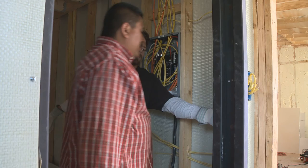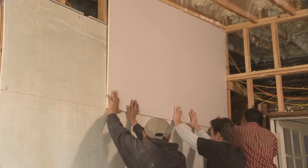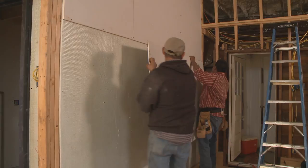Once Armor Core is in place, the drywall can be hung so that the walls can be finished out to maintain the same aesthetic as the other rooms. It is possible to adhere to or paint the Armor Core directly. In these applications, the Armor Core should be wiped clean using acetone, or an extra layer called a peel ply can be added in the manufacturing process. The peel ply is pulled off in the field during installation to provide a clean, slightly textured surface ready to work with.